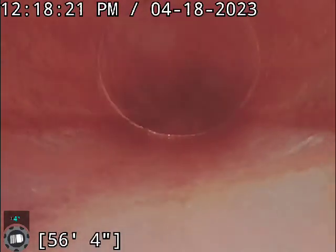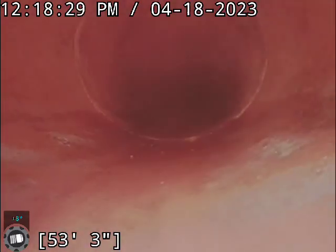This is after doing the repair, right at the footage, the earlier video, it was between 40 and 46 feet. That's where there was some cracks and some offsets in the line. So we actually replaced that section between the existing ABS plastic and the 6-inch lateral pipe. So we ended up putting a new section of ABS plastic. We installed with heavy duty connectors, all city approved material, and we connected to the existing 4-inch ABS plastic and the existing 6-inch lateral pipe.